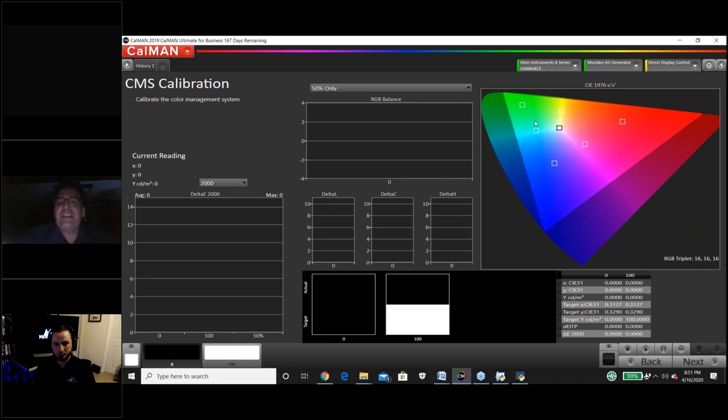So we're dealing with DCI's colors within a 2020 space. The other part of this is, just like in SDR, I was aiming at 75% stimulus because the color correction might not go linearly or even all the way out to 709. It's the same thing in HDR calibration. It definitely doesn't go all the way out to 2020. Lots of the time it doesn't even get all the way out to DCI.